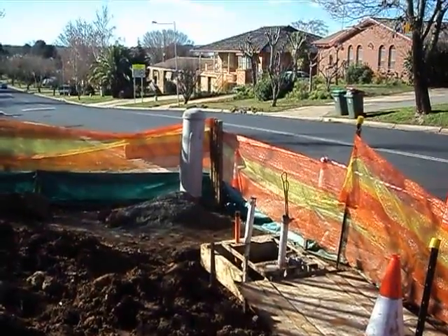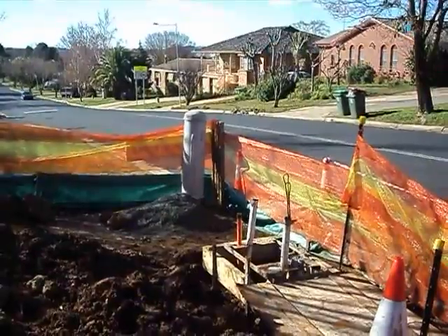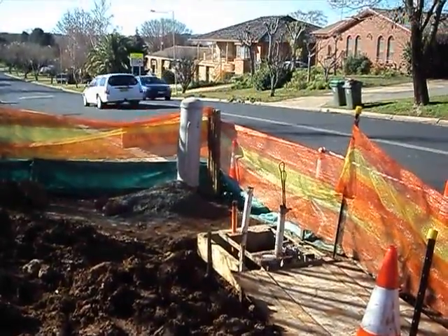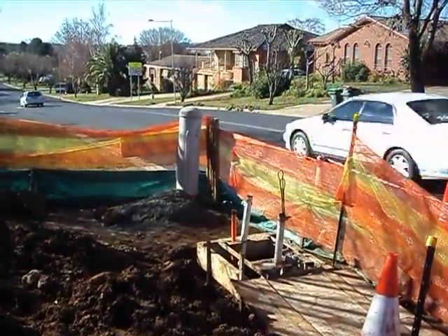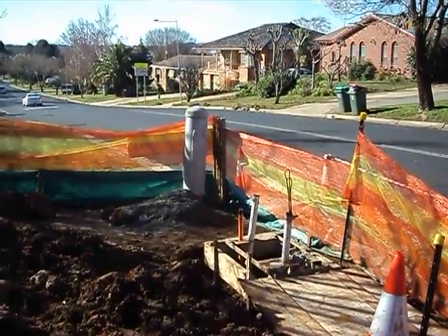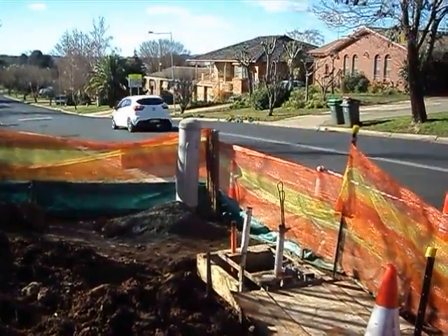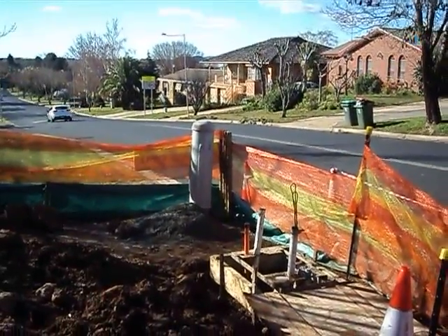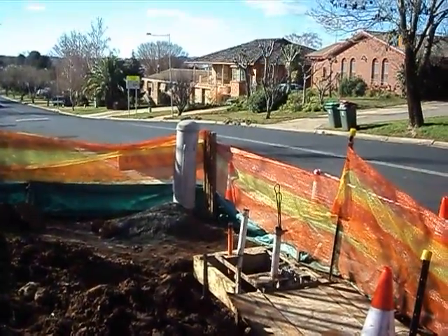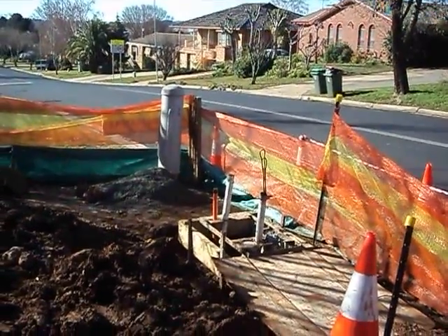The best system, which is fibre to the house, runs fibre all the way from the exchange to your house. It would look similar here — there would be a cabinet, but all it would hold inside are just fibre terminations from the large optic fibre coming from the exchange, and then it would just be an optic version of that silver pillar in the corner. So it requires no power, it's all just run directly from the exchange, and there's little or no maintenance.